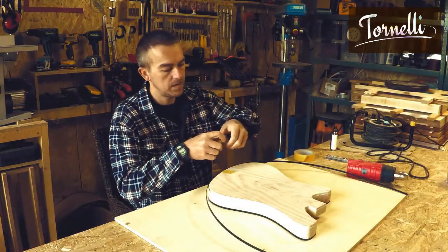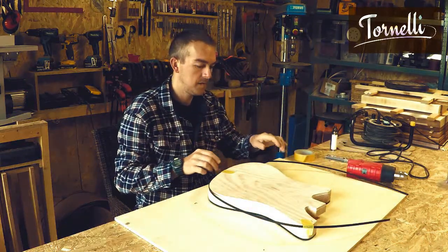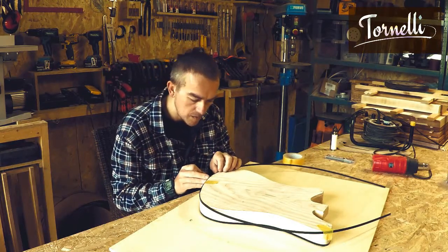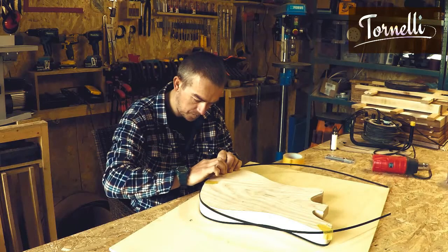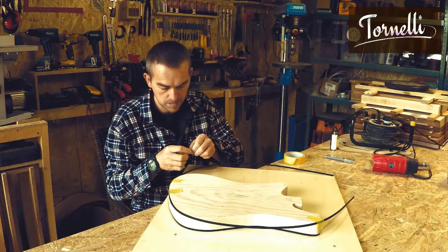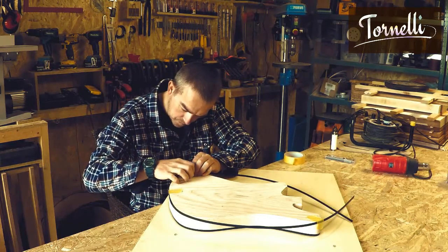When it comes to actually installing the binding, I'm going to tape the binding into the channel around the guitar first before I use any acetone. I'll put a piece of tape about every six or seven centimetres so that when I come back to do the acetone there'll be plenty of space left in between the bits of tape to apply the acetone and tape up all the gaps. This gives you plenty of time because you're not trying to bend, manipulate, and press the binding into the channel at the same time as gluing it.